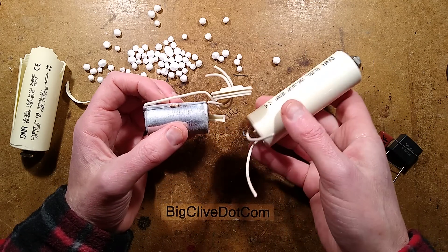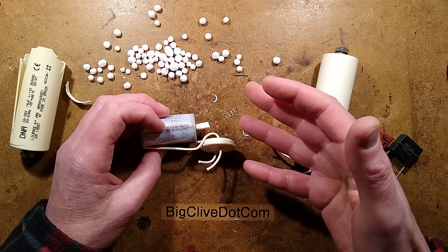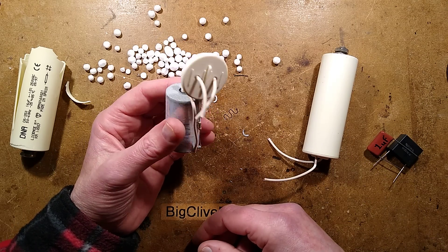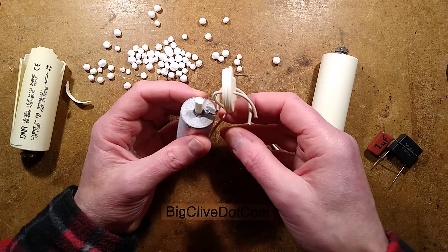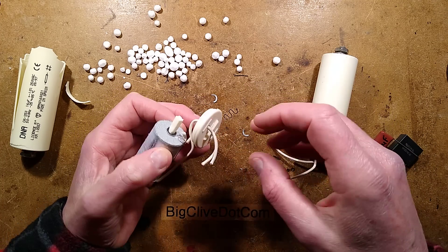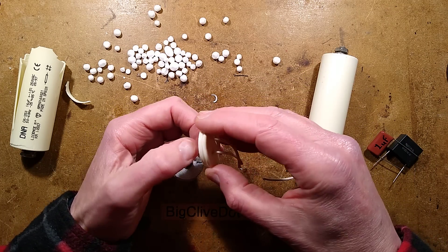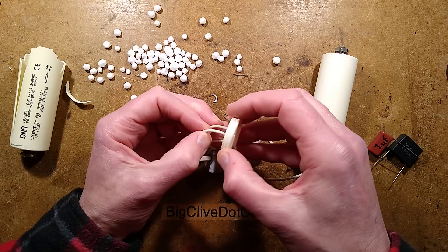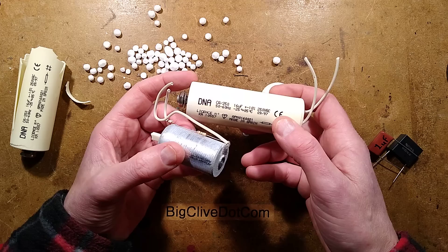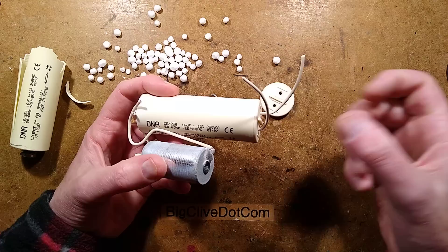This is good because these things, if they don't have that discharge resistor, they can give you a nip at times. People who work in the streetlight industry - particularly the veterans - will know this. Sometimes the capacitors fail and you go up to the light fitting and the fuse is blowing. Sometimes the fuse just fails, especially if there's a bad connection, even a bad connection to the fuse holder itself causing arcing. The capacitors will pass that as current and it blows the fuse. So quite often you'll just stick a new fuse in. And sometimes these capacitors, particularly the old metal can ones, will start venting - and then it's basically you grab the joystick of the aerial access platform and yank it to the side to get out of the way before it explodes.